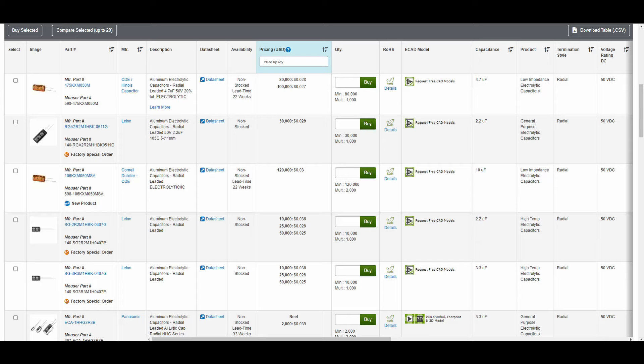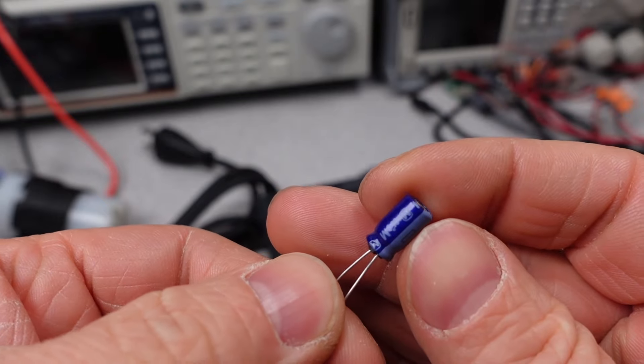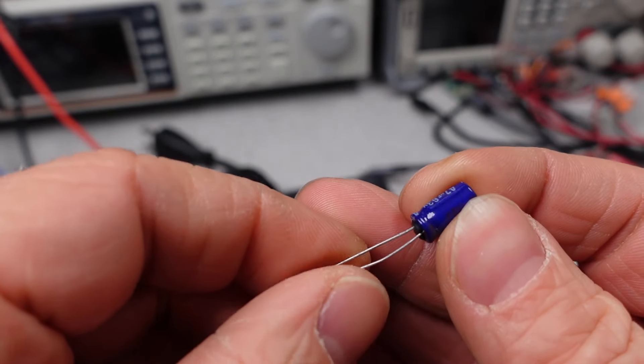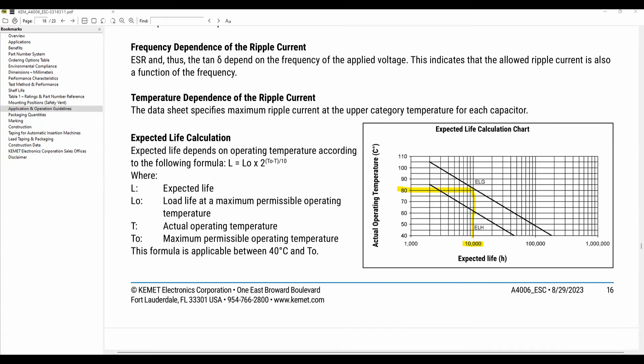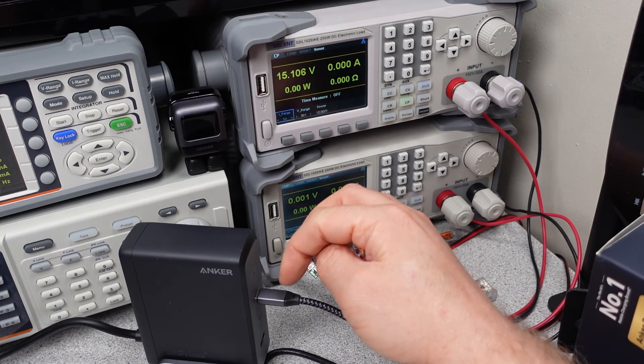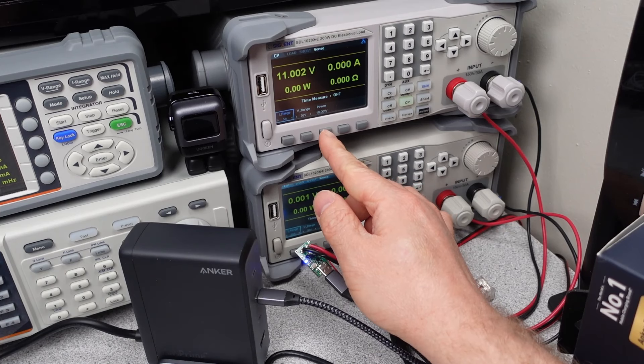Well, you care because your stuff breaks early because of these parts. The power supply needs these parts to be able to supply the larger output power to make your laptops and phones buzz along so you can watch the video. This is the part where I accidentally trick you into learning something. So, why does this matter? I don't want to get too far into the weeds here, but this is a datasheet for a capacitor and this is why this matters. These have a thermal lifetime — they tell you in the datasheet. You run this hot, this premium high-temperature rated capacitor stuffed deep into the power adapter surrounded by other hot things is only rated for 7,000 hours. That's less than a year. That's for a premium one. If you use a cheaper one, don't expect it to last that long. They give a chart in this example where the hotter it gets, the less time you get. It is hot inside these power supplies — real hot. So they are pushed to the limit and operated on the edge. The capacitors have liquid in them and they literally dry out. As they dry out, they lose both the ability to store energy and the ability to deliver whatever energy they have stored. So it's lose-lose — your power adapter or charger doesn't work anymore.